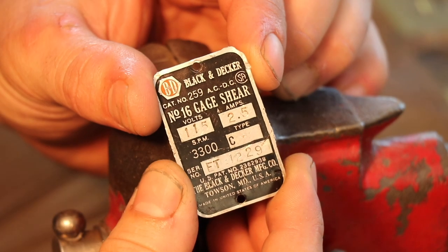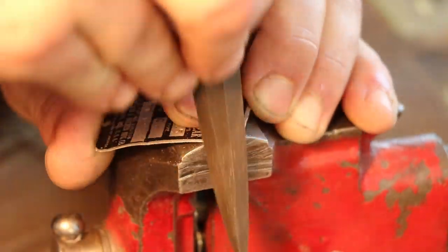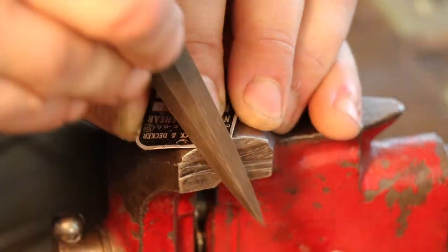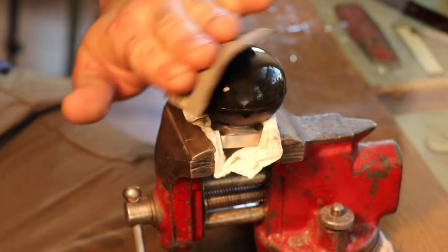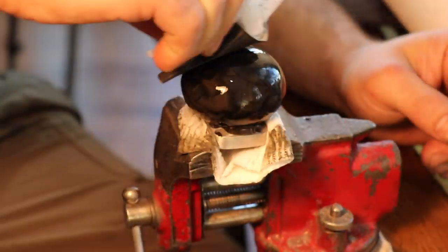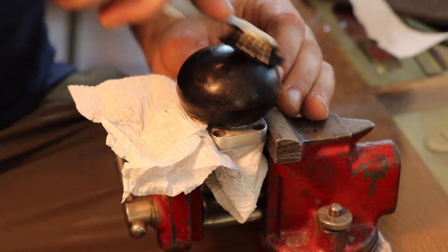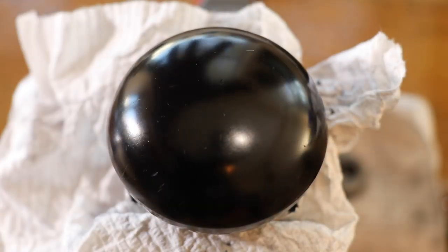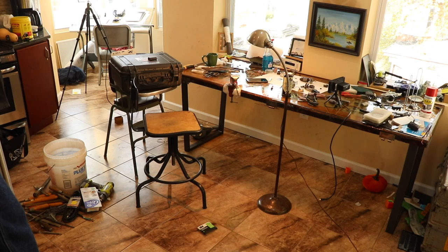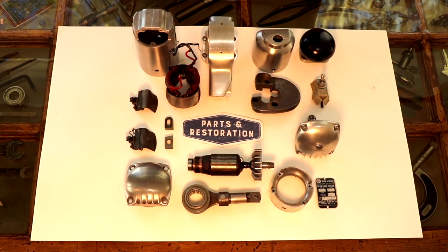Take a look at this — beautiful. You can see a couple of deep gouges in there; nothing's perfect but I did the best I could. There are some flattened-out spots where this thing took some hits over the years — that's just soft aluminum. For the plastic part I used 600 and 1500 grit wet, and then I used black shoe polish — which is mostly just paraffin wax anyway — buffed it on. It feels like plastic again, and all the wax that got into the little scratches filled them nicely.